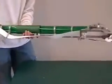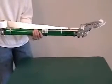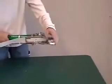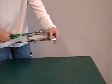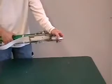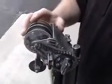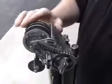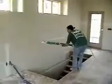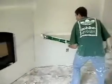To extend the arm wheel for taping flats or angles, extend the sleeve toward the taper head without the advance lever engaged. There is enough spring action on the wheel that with the sleeve fully extended, the wheel can keep its tension against the tape. This tool's metering system is not a wheel on the board pulling a cable and thus putting mud on the paper tape. You are the metering system. You control the amount of mud that goes under the tape.